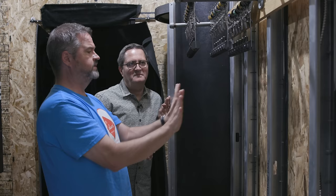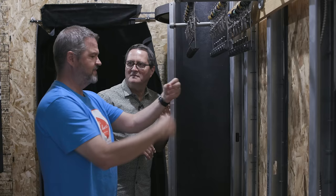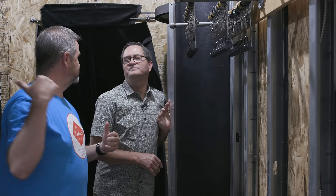And so we touch, we make sure everything's okay, and then we wrap our arms around all this film that's here and make sure everything's perfect. On 120 film there's paper. So if you don't hug every rack, that paper might be hanging down there. Might have something hanging on there. And there's not clearance in the machine. So you have to make sure that this is all perfect before you put it in.